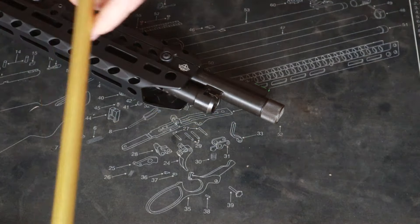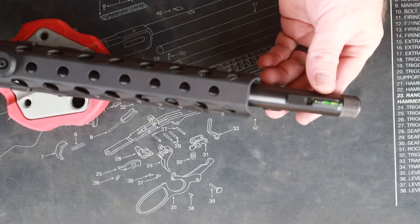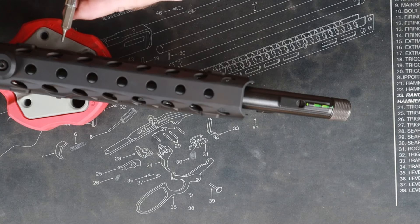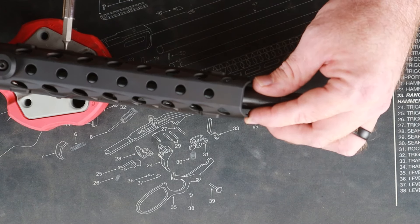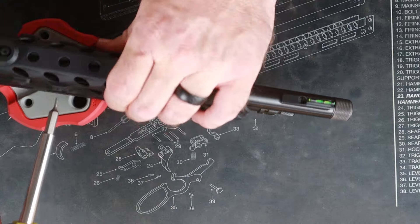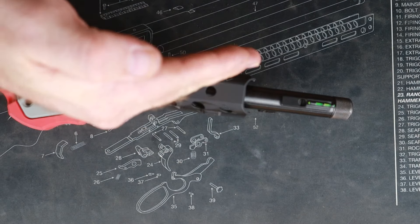Just to get this off the bench, go ahead and install the inner magazine tube, rotate it, and lock it into place. Now something I want you to see: the handguard is a little proud on one side versus the other. The set screws that go in and touch off on the side of the barrel are going to help set that tension. Use the backside screw to pull it until it gets even. Use your eyes to make sure the handguard is drifted and centered, then run the other side screw down until it touches off on the barrel. That'll lock it in and keep the handguard from being askew.